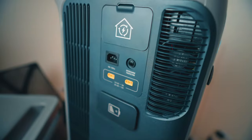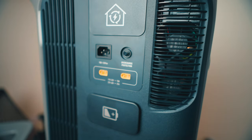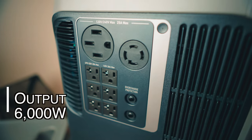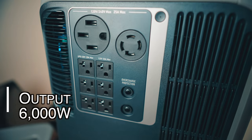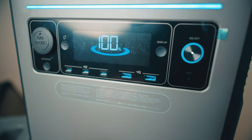It powers 120 and 240 volt appliances. As far as inputs go, you're looking at two XT60 inputs for solar or DC charging, 2,400 watts solar input, and a blazing fast AC charging speed of 1,800 watts. DC charging from a car would take a really long time and is not recommended. It uses a lithium iron phosphate battery, which comes with a five-year warranty, a ten-year lifespan, and over 3,000 total life cycles — so zero to a hundred at least 3,000 times before you see real degradation down to 80%. Outputs include a connection port for the home transfer panel, six AC outlets at 120 and 240 volt, 25-amp max NEMA 14-50, an L14-30 outlet to directly charge your EV or RV, three USB-C outlets, two USB-A, and one DC car outlet.